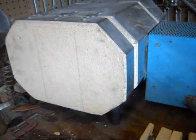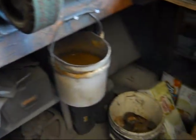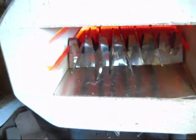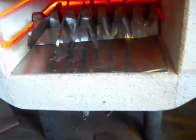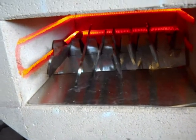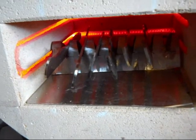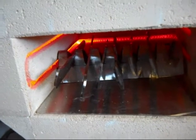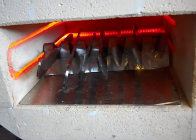The ovens aren't cheap to come by. So what I did was — here's a piece of stainless steel, and I cut it to size and put a floor in the oven. Now nothing will drip on the floor. And I also cut a rack, which I'll take a better picture of after things cool down to show you what that is. It's just a piece of stainless folded over and cut out with an angle grinder. I've got slots for seven knives in there; I've got six in there currently.